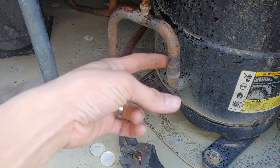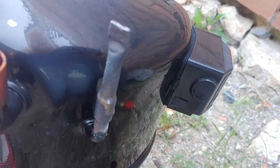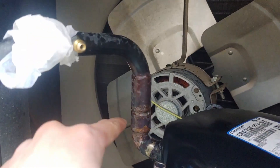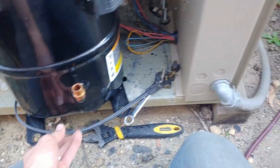I'm actually thinking about unbrazing these. I got a plug brazed on the other compressor right there — could in theory add a port there, but there's not really any reason to since you've got good ports over there. Then I got that unbrazed, and we're just going to unbraze that one. Just wrap a rag around here so I can lift up on the pipe.